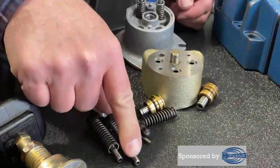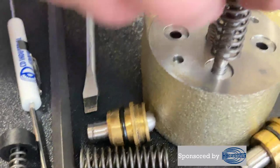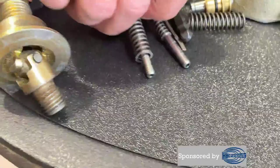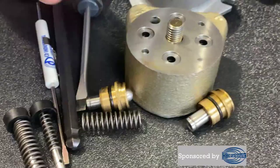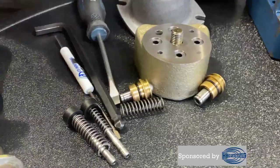It's important that the servo or pilot pressure supply be kept very clean. For this particular valve, ISO 4406 cleanliness code 18/16/13 is required in order to function reliably and not malfunction due to particle contaminants — and you can see why, given the very close tolerances at work.